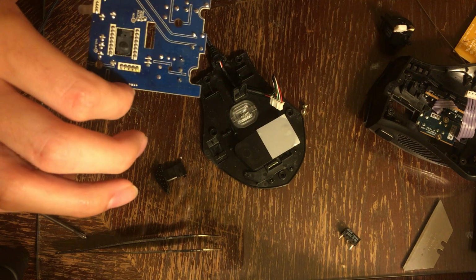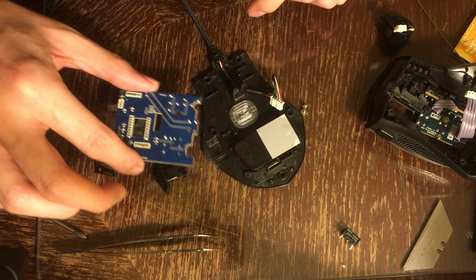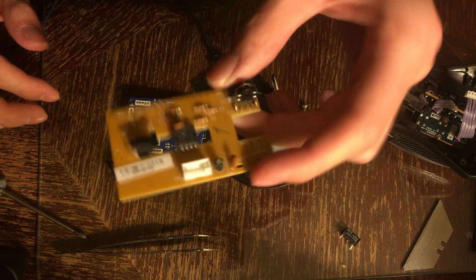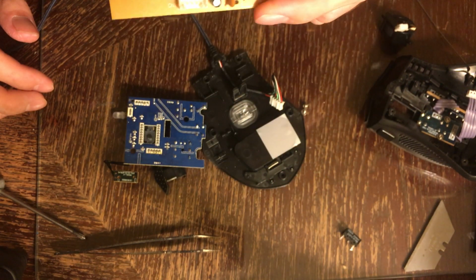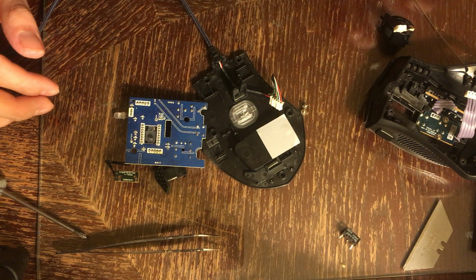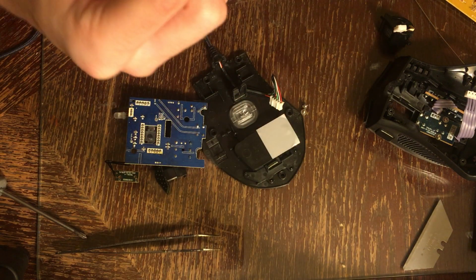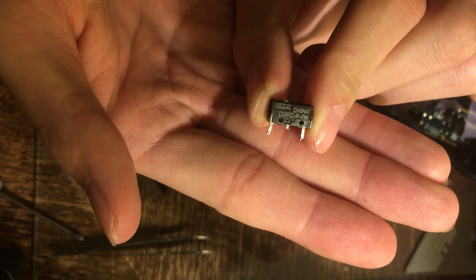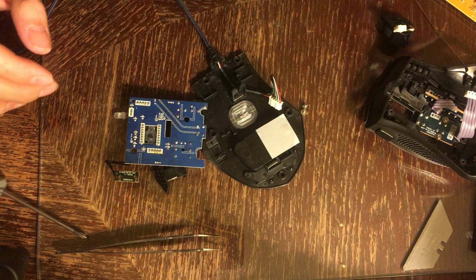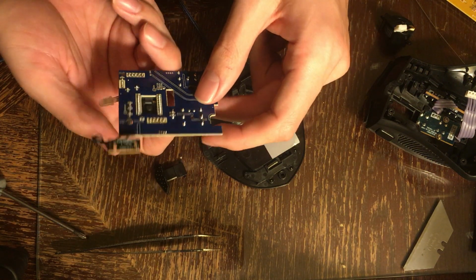And if you want to replace the left click, or the right click, that's going to be over here. And the easiest way to get replacements is, well, with another mouse. So I just had this little donor board here, a cheap mouse. Probably buy one for $5, as long as it uses the switches that have these 3 pins here, with the middle pin being the click, which I accidentally broke off desoldering it. But anyway, time to put it back together once you've got that soldered up.